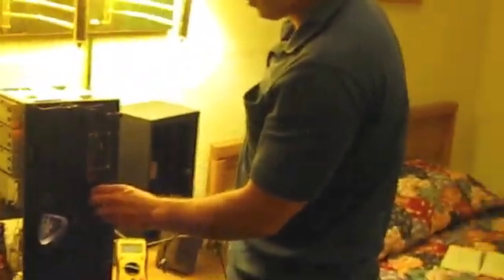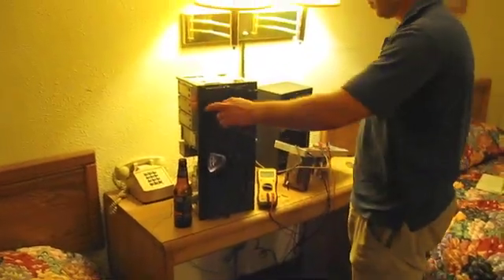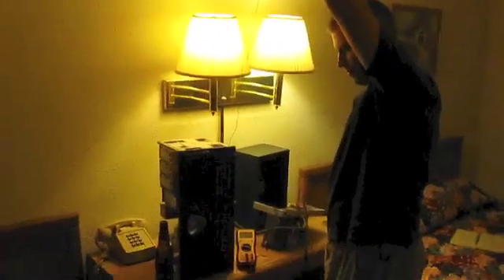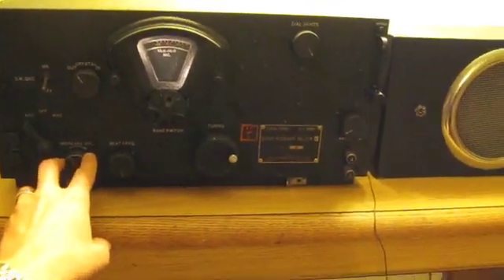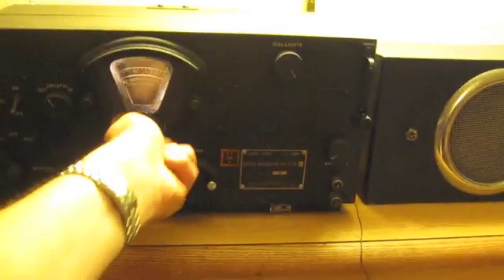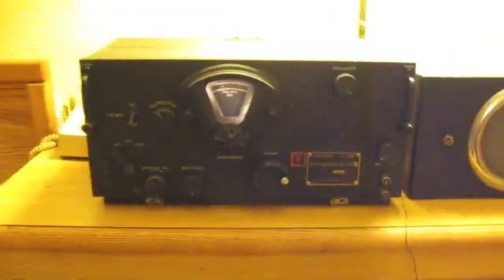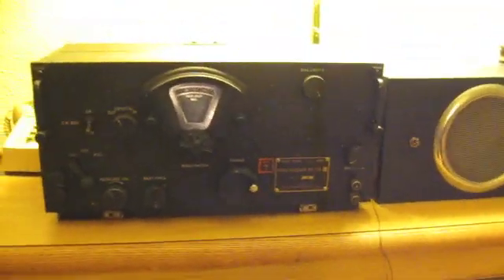24 minutes — my watch is right on the money. You're off by about 2 hundredths of a megacycle. We could fix that, not a big deal. It's coming pretty strong with that 2.5 to 3 feet of wire there. We put the radio back together and it's playing pretty well. It has a couple of minor deficiencies — the crystal filter is a little quiet, which is apparently normal, and one band is kind of dead and needs a little work. Otherwise, we've successfully tuned in sideband already tonight on 20 meters, so in addition to CW and whatnot, it's a pretty nice rig.